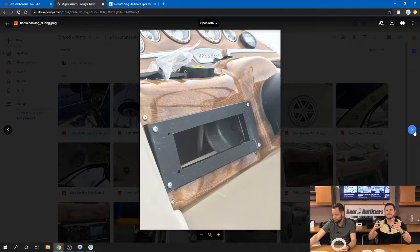Absolutely, plate. A lot of the radios that are being made now are pretty water resistant. A lot of the Fusion radios can handle getting wet, so they don't necessarily need the old radio mounting housings with the flip up cover or the drop down cover, and those cutouts were really big. So when you're switching from one of those old housings to a new Fusion RA70 or something like that, you're going to have a bigger cutout than what you need, and that's what this plate really helps with. With the electronics being made waterproof, you don't need as much housing around them, so they've all gotten smaller, so that makes sense.